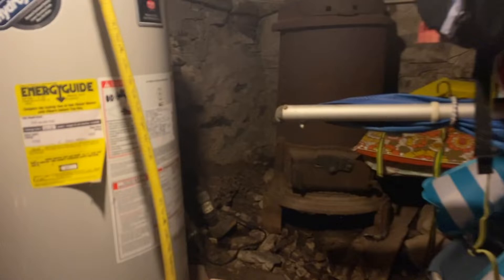Once those are closed, head over to the hot water heater. That also has a drainage valve that has been opened up so that the hot water heater should have been drained. You're going to want to close that drainage valve before things come online.